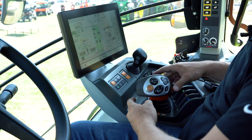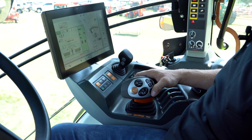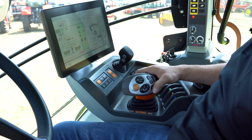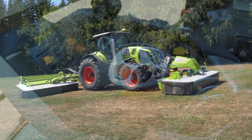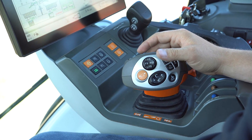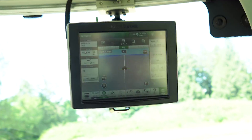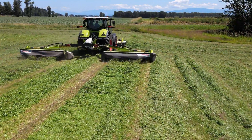One thing to know: you do have to be moving for the sequence to work. If you're at a standstill and press sequence one, it will show an error saying you're not moving. You have to be crawling at least. When going back into the headland, I get close to my row, press the auto-steer button, then press sequence management button one and the mowers come down. Coming to the end of the headland, I press sequence two — it raises the front mower, then the rear mower — then we turn and that deactivates the GPS.